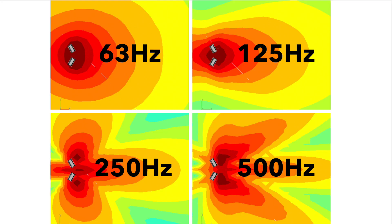In fact, we want to maintain most of what's going on here because we want the maximum output in this range. This is such a difficult range for smaller speakers to handle, and we don't want to mess with the phase relationship too much because it'll just result in less output. We're going to have a lobe somewhere — there's only a few lobes and they're going to point in some direction and we can't completely get rid of them. So we want to leave this range pretty much untouched.